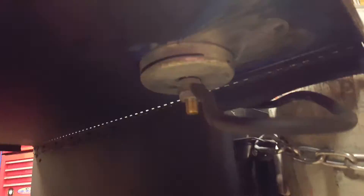The nice thing about this table though is I actually have the ground doubled up. You have this ground here and then I spliced another lead into it, which goes back here and it's on a magnet on the bottom of this table. So the table — obviously you don't have to pull your ground off. You can weld right on the table, which is great.